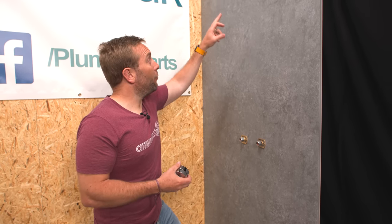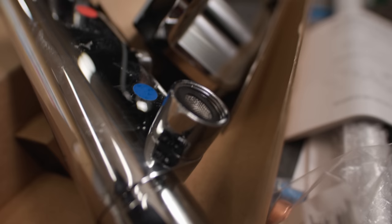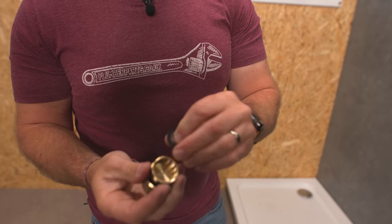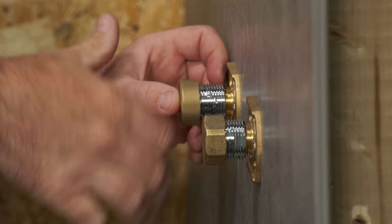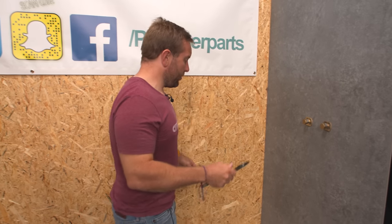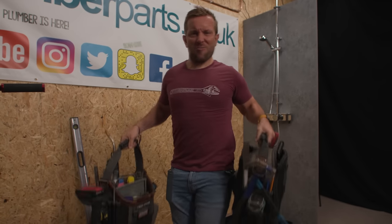All we've got so far is one hole here and one hole up there. A little Plumber Parts tip: those little washers you take out from the old bar mixer valve, you can reuse them on the inside of your caps if they're in good condition. These three-quarter female caps will fit in there just nicely. Wind them on hand tight — rubber fittings are properly watertight done up by hand, because people get it wrong so many times by over-tightening rubber fittings. Still gonna give them a little nip up with the spanner. All the tools I use in these videos you can get on the Amazon store — links in the description below.